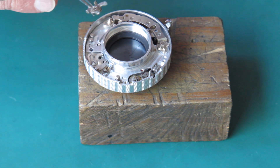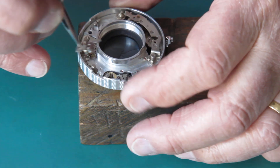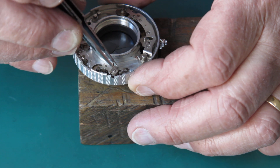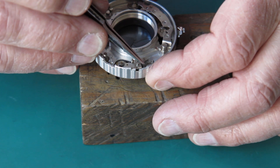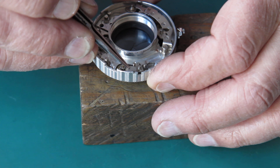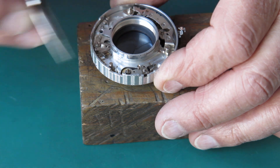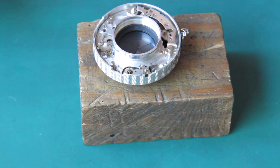This is part of our flash sync mechanism. I'm just putting a smear of molybdenum paste on the tip of that where it latches. It pivots on that post. I'm checking the position so that when that's swung across, it latches behind it and is held in place. The arm on our flash contact needs to swing along the side of that piece there, and at the moment that looks just right. We can leave that there. I'm going to put the moving flash contact in first.